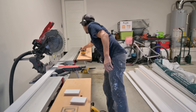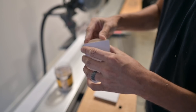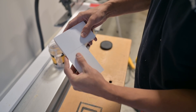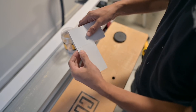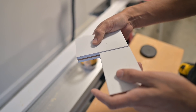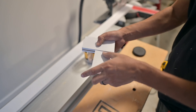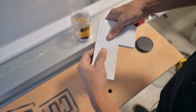Now that I have that slot, I'll take one of these biscuits — it's just a small piece of compressed wood — and it slides in here, and into there. See how there's quite a bit of movement but I can still get that thing to line up. The whole purpose of this is to prevent misalignment. We don't want one board stepping down from the other. Some of that we could sand, but if you have a biscuit in there, I can't even do that if I wanted to — it's going to line it up.